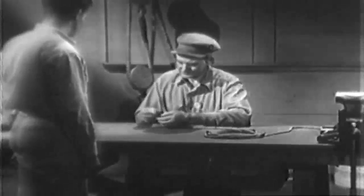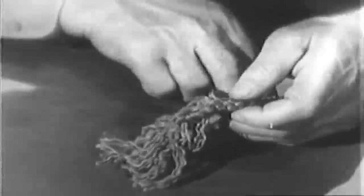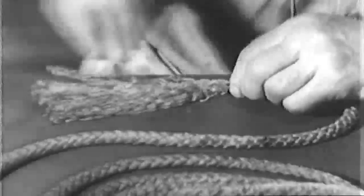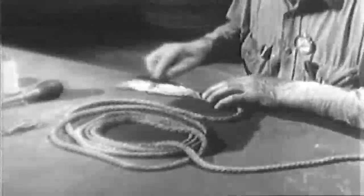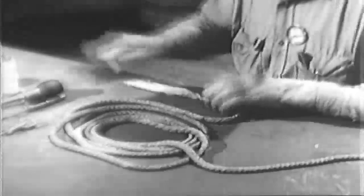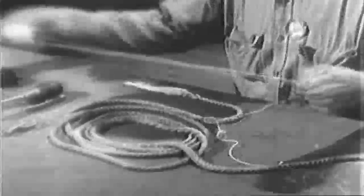Another type of rope of entirely different construction is the unfinished flax, wax rope or treated cotton line used for signal halyards. This type of line is braided instead of twisted and has a hollow center which makes it very flexible. To make an eye in this type of line, the tapered end is bound with waxed sail twine and threaded through the eye of the snap hook.